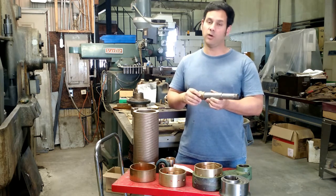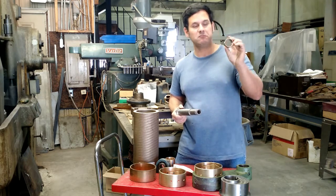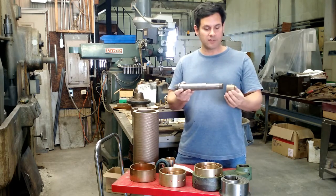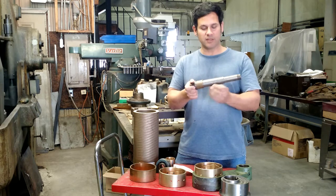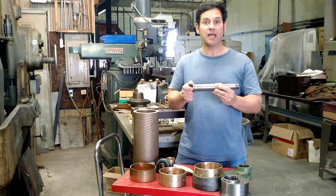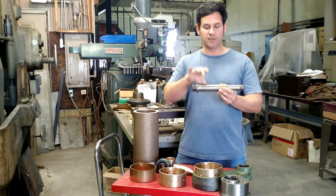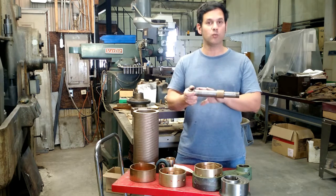So are they better? Well, as long as you're not spinning very fast, this is a $20 bearing. If I were to use a pillow-block bearing in this situation, it would be a $100 bearing — very inexpensive. I need two of them, still not quite a big deal. The issue is that the bearing in the front and the bearing in the back have to be in perfect alignment. You cannot install these if they are not perfect. Typically that requires special tooling — you might need to hone these in place. The shaft has to be in excellent condition, and you can see there are wear marks on this shaft, which wouldn't fly.